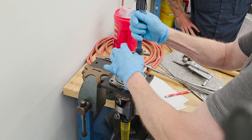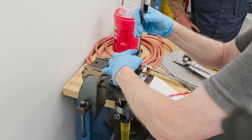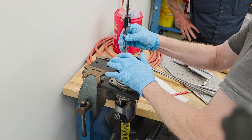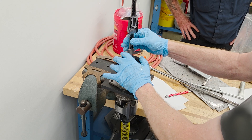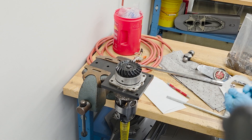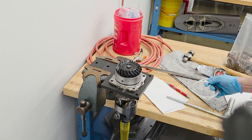If I get this thing back together today, I'll have one done and say come get it tomorrow. That was the wrong way - that's why I've got to read the book. I looked at the number with it upside down because I zeroed on the tool and didn't look properly. Right there: 2.765. It's got the same dimension that I took it apart as. I'll just put it back together, set the rolling torque where it should be, and it's good to go. I'll clean the shims off with parts cleaner, wipe them all down, and put it right back together the way it was. Retorque the bolts, install the bearing, and it's ready to go back together.